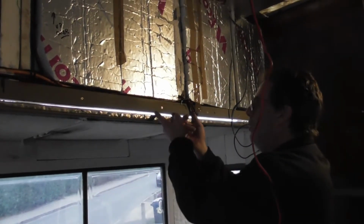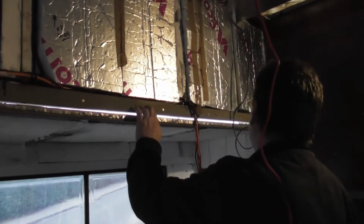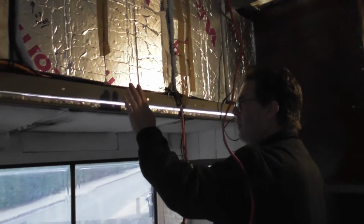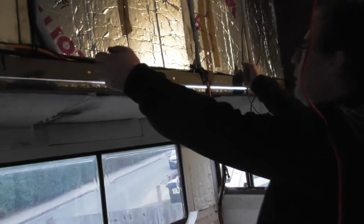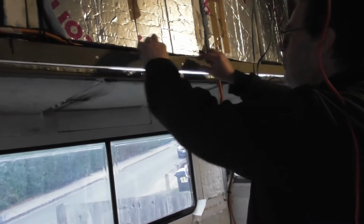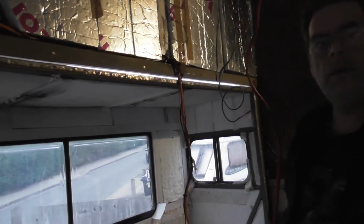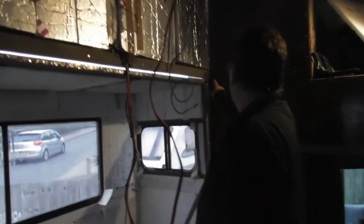These screws hold the wooden seal on the outside. That seal isn't glued in, because I would quite happily drill a new set of holes and that'd be the end of it, and I need to be able to access that in case it starts to rot, and we don't want to be ripping walls off just to get to a piece of wood that happens to be on the outside. So why can't you get your phone and photograph where they are now? No, I've got to measure them. I've got to measure them and write down the distances from wherever I measure from, which will be from this edge here.